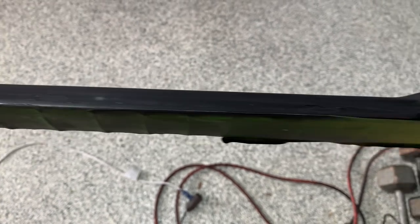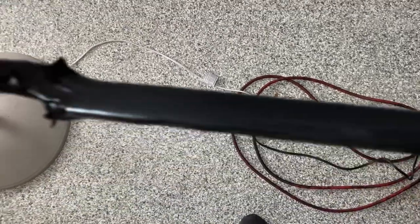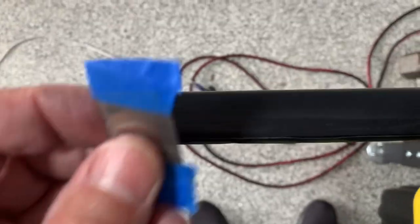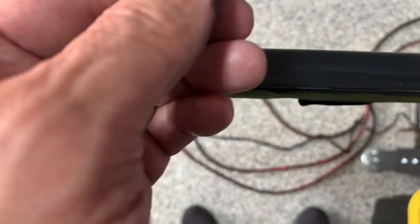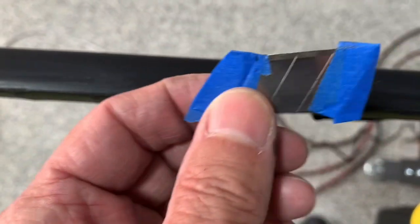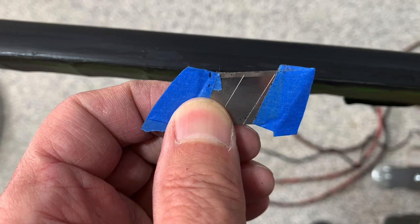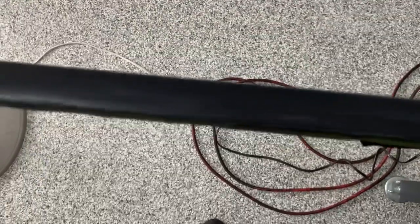Now, this is going to happen at some point, sooner or later, and you can see I've been sanding — a little wet sand. I masked the headstock off, and what you do is take a piece of a box cutter, which is a razor blade, or if you have just the old school razor blades, tape off an end.